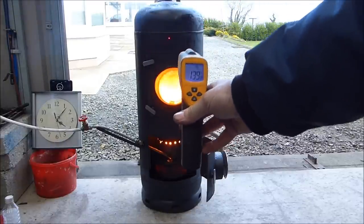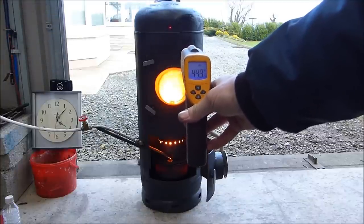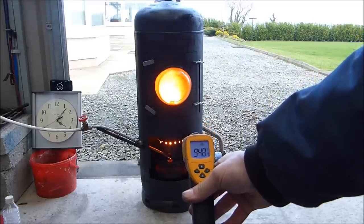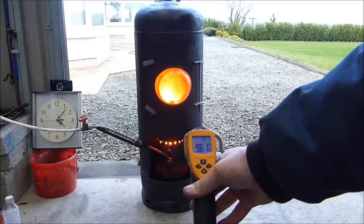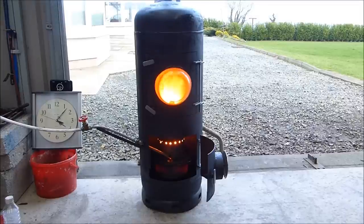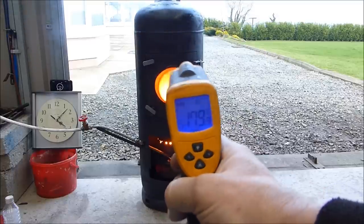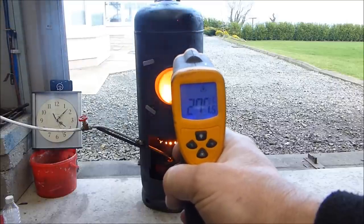We're going seven minutes now. We're up at 454 Fahrenheit on the side walls, and nearly 1000 Fahrenheit down in the secondary burn chamber. The smoke isn't leaking — the smoke is just from the paint. That's 514... 277 degrees centigrade for Europeans. I mean, if this project was no use and it didn't work, I wouldn't be putting videos up on YouTube — I'd just scrap it.